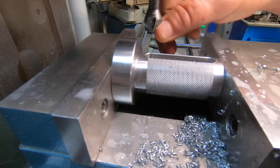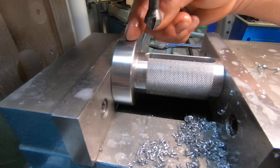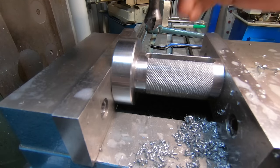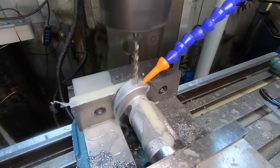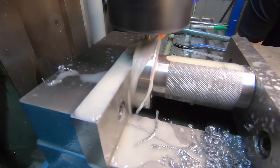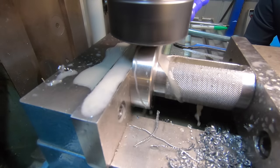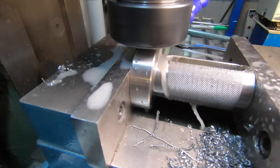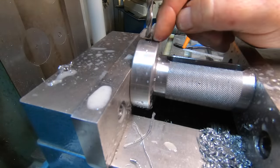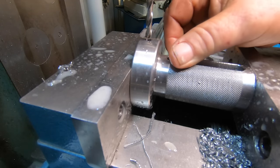Okay, that slot is in and chamfered around the outer perimeter. Wire still on center line. I'm going to punch a 5mm hole down through the top and the bottom. That'll be where the set screws go. It'll save just picking up on center line again. Okay, off camera, I will just do a little countersink and then tap them M6, both them holes. And they're done, this piece is finished then.